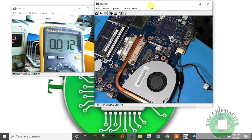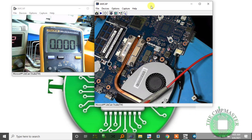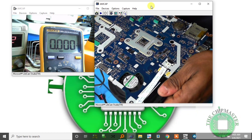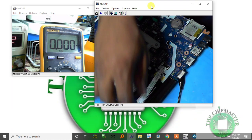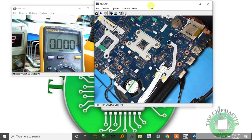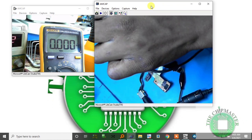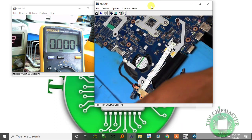Can anybody tell me where the problem is? I just had my breakfast. I'm getting all supplies, the reset and PLT reset are there, but we're not getting a display. I'm going to connect the keyboard. But the current should still be more than that. Oh, could it be that the RAM is bad? I didn't try another RAM. So we should check the RAM.